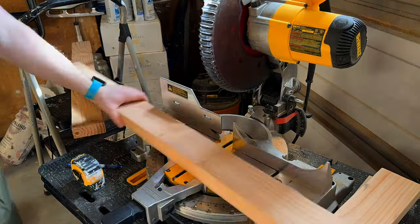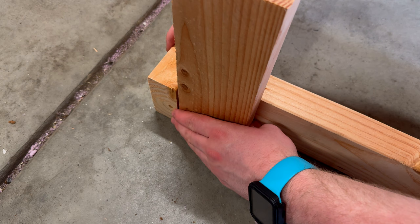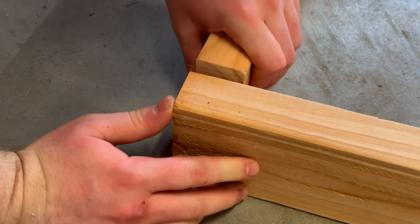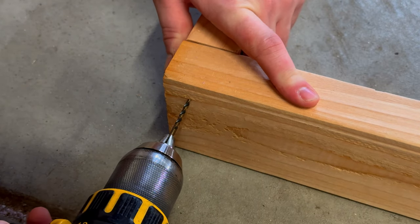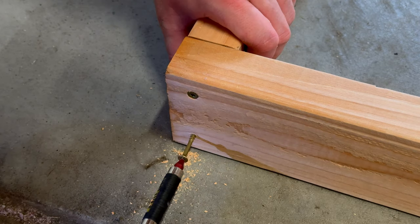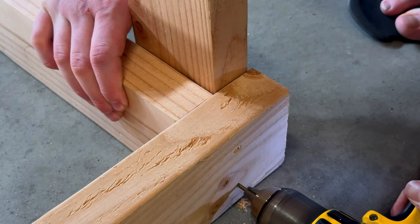Following the same process of overlapping the pieces, lining them up with the saw, and making the cut, once all eight pieces are cut we need to start assembling everything together. Start by laying down the side piece, followed by the top piece, then for the bottom piece account for the thickness of that two-by-four we measured for earlier. Attach everything together using a drill and some two-inch multi-purpose construction screws — any wood screw will work. I recommend pre-drilling the holes with a bit slightly smaller than the screw thickness. Line up the top piece with the side piece in the corner on a flat surface, pre-drill the holes going through the first piece and into the second, then add the screws. Repeat this step for the bottom piece, using another two-by-four to space it before you drill.